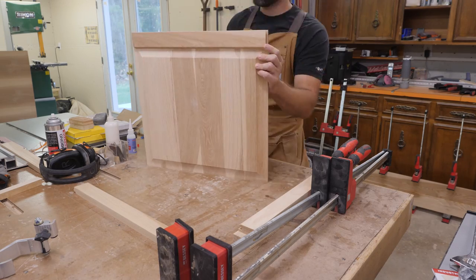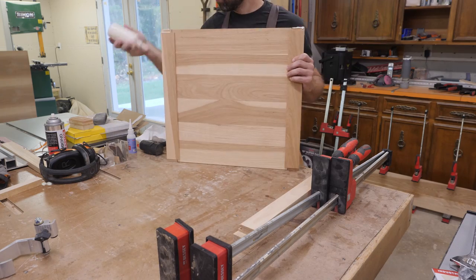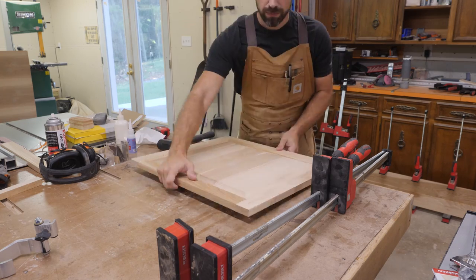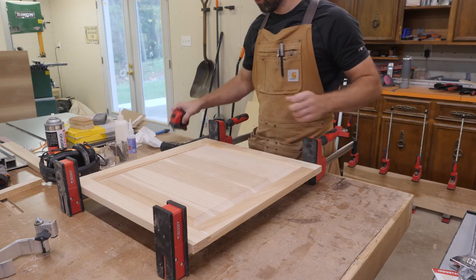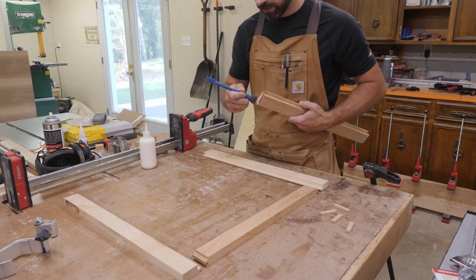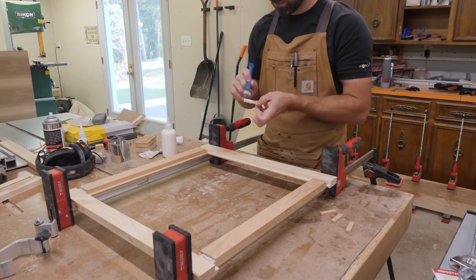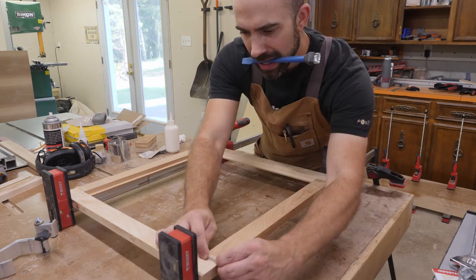With all the pieces to their final size it's time to glue up these doors. I start by centering the rails on the panel and apply a thin layer of glue on each of the tongues. I then set the stiles in place and adjust the pieces until everything is square. Once the panel is in clamps I check for square one last time by measuring across the corners. Gluing up the doors that will have the glass insert is essentially the same process but obviously without the wooden panel. With the way I cut for the glass insert I will have missing material in the back of the door frame, so to fill this gap I cut some spacers and glue them in place once the rails and stiles are loosely together in the clamps. After a little sanding and finish these spacers are practically invisible.